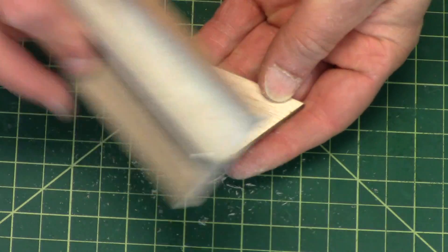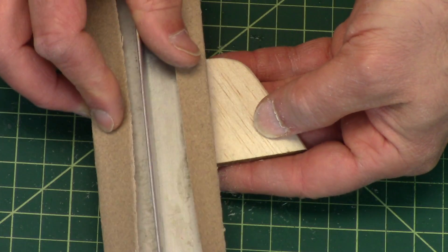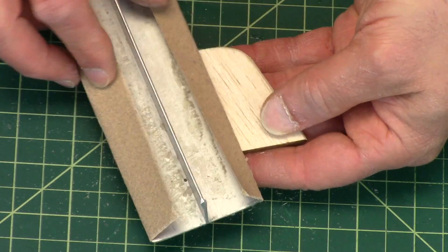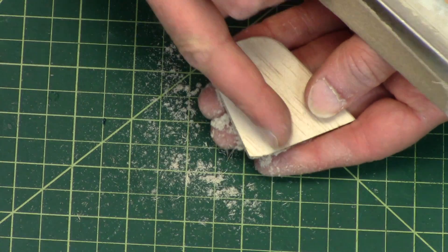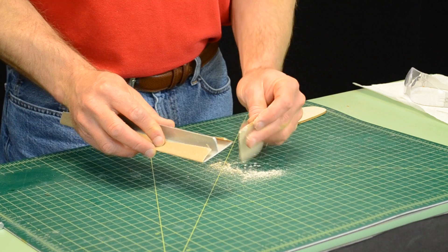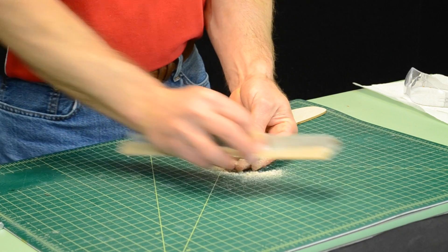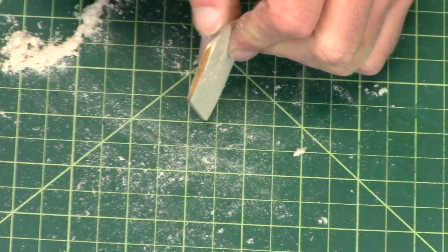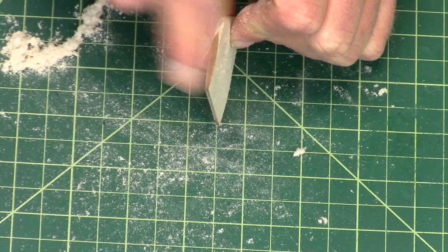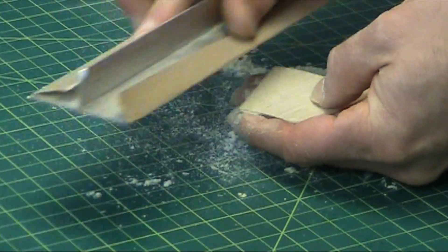And then for the trailing edge, this one is going to be the knife edge. So as before, I'm holding it flat, but my sandpaper is angled just a little bit, and I'm working from the back edge towards the front. You can see kind of my line right there. And then I flip it over and do the other side. You can see from the top surface it's starting to take shape if you look at the black right there. So just keep working it until you get that knife edge along the back.